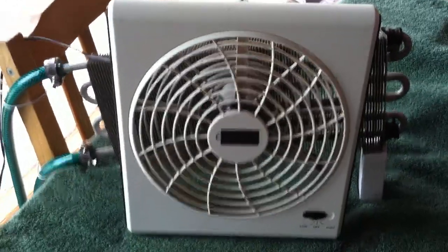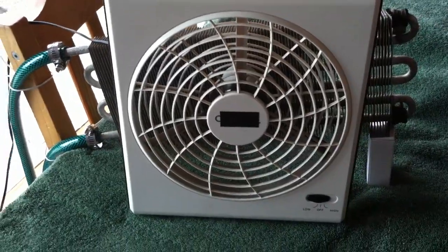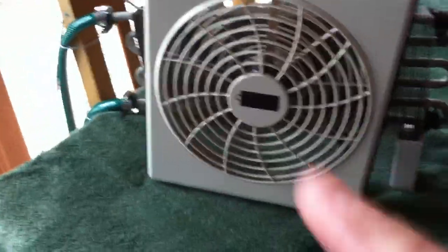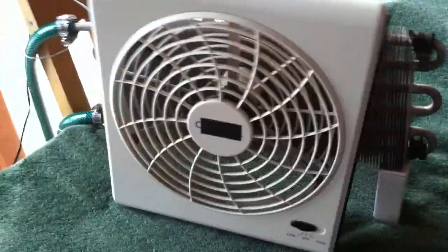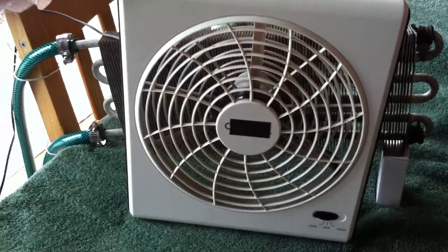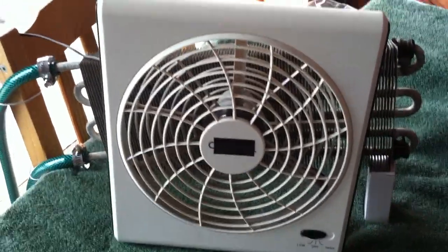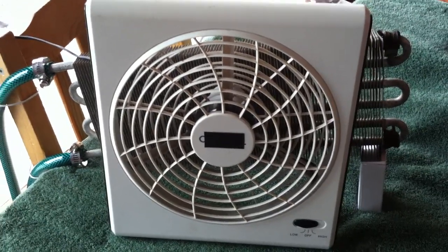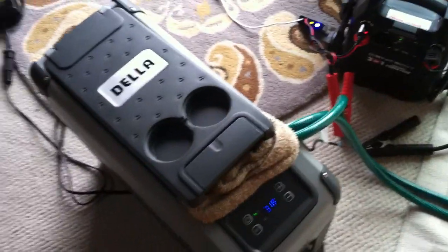This is basically a cold water powered air conditioner. Now, if the water at Catalina Island — where I'm going this summer — is down in the low to mid 60s, I can do it this way without the refrigerator. I just put the lines over the side of the boat and pump the cold water in. But if it's like it was a few years ago, where it was 68-70 degrees in the water and the air temperature was 82 with 80% humidity, I'm going to have to go with a compressor air conditioner.